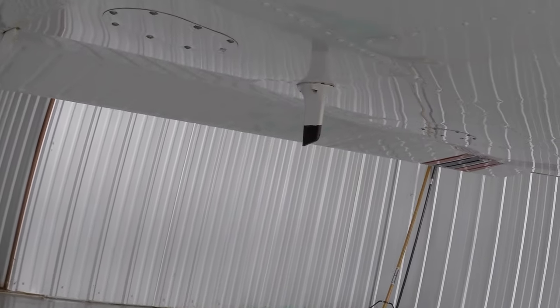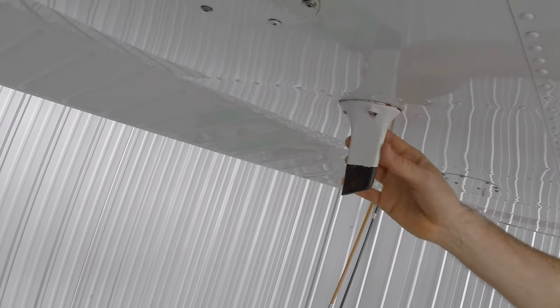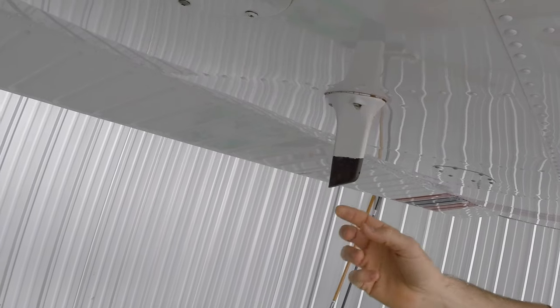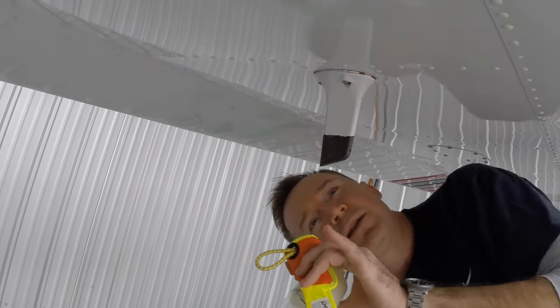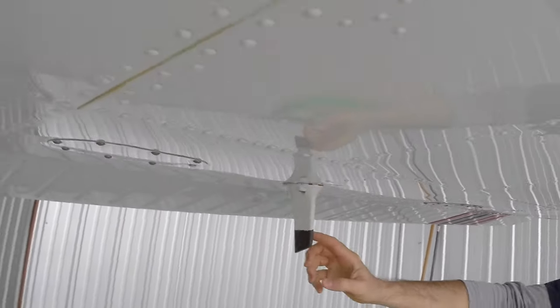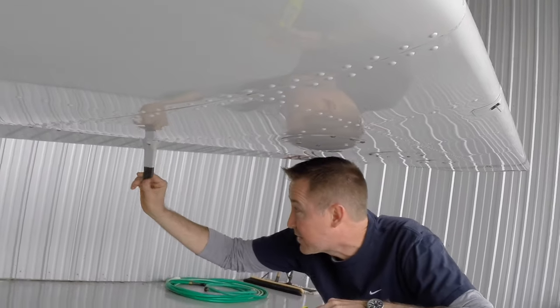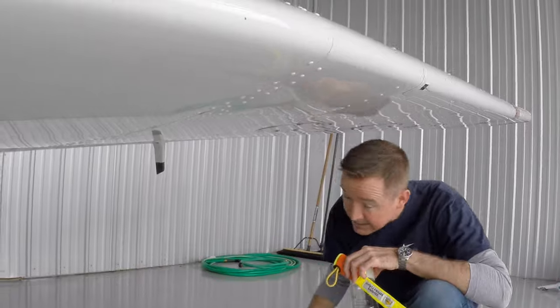Again, underneath, this is our Piper pitot-static blade. We have a hole on the front. We have a hole on the bottom as a drain. We have a tiny little hole in the back for the static port. This is an all-in-one unit, pitot pressure and static on this airplane. So we just want to make sure all these three holes are clean and clear.